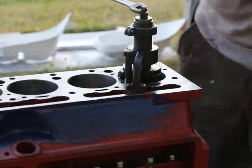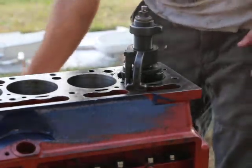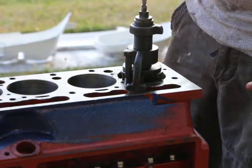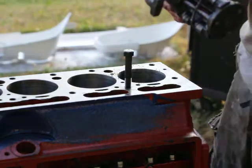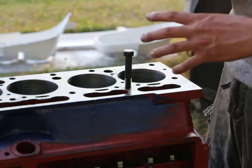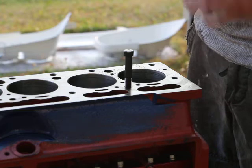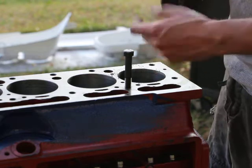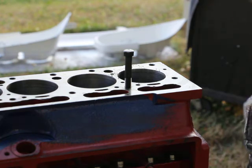That's pretty much it — use water or coolant, don't use heavy oils like engine oil. Remember to clean off the blade on every pass. One thing that's really important is to clean off the cylinder itself. If you don't, the rollers are going to roll over the little cast iron shavings, and that's bad. Just keep things as clean as possible.